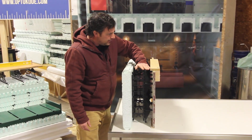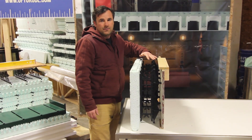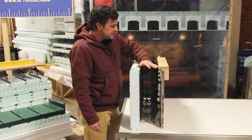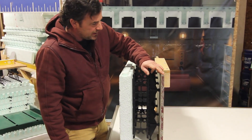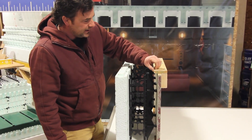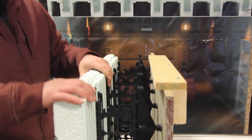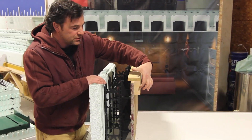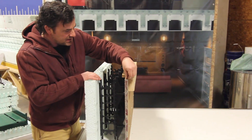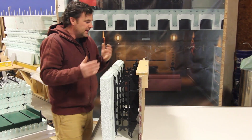Keep that just nice and short so the concrete can fill up. As long as the concrete's just a little bit higher, the whole backside when you fill it can look however you want — it doesn't have to be perfect. Because we have this formwork nice and tight, the concrete doesn't come up higher than the form ply. It's set back, and then later we strip this all out. Then we stack our next row up, this row of ply stays, the foam always stays. We just keep stacking up, and when we do a two-by-six ribbon again, the plywood's just tight together and that concrete line is perfectly along that plywood seam. That's how we did that cold joint.